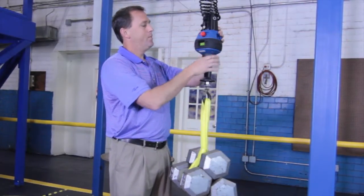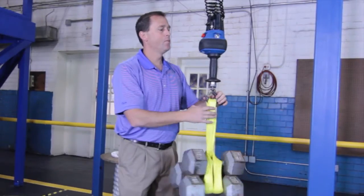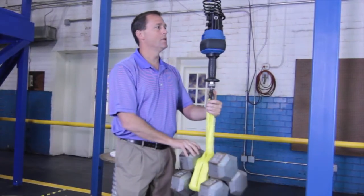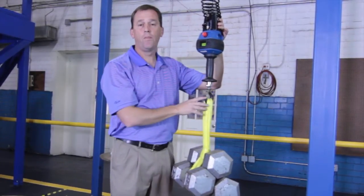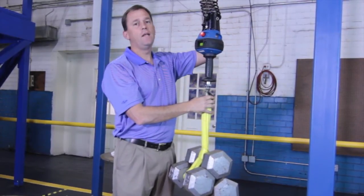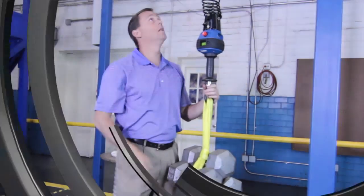Moving up, we see we have a 360-degree swivel. As the load is being suspended in brake mode, I can suspend, move, and rotate in all directions. Here we have the information cable — that's where all the brains are. It's in a spiral and it's speaking with a computer in the hoist. Housed inside here is rotation-proof wire rope, and that's what's suspending the load.